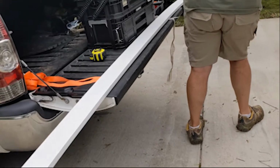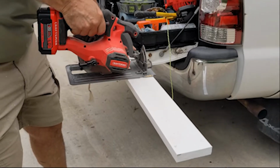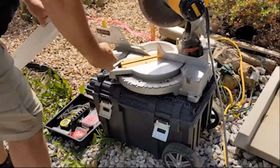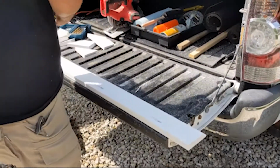Okay, just got back from Lowe's, picked up a 10-foot stick of PVC trim. We're going to cut it to length, miter the corners, and then use our table saw to route out the back so that it can overlap over the top of the vinyl siding.